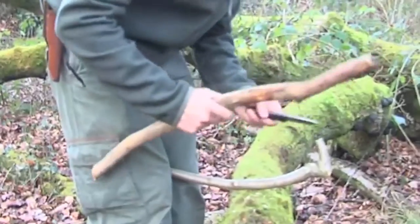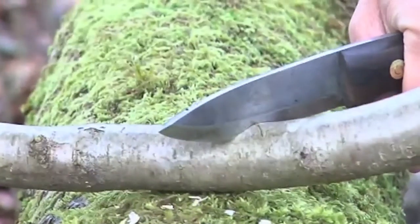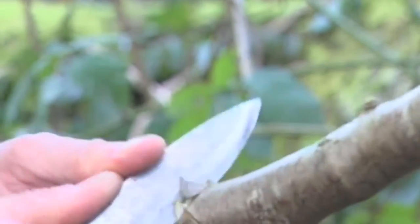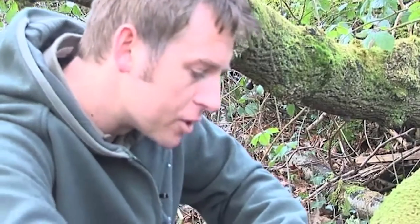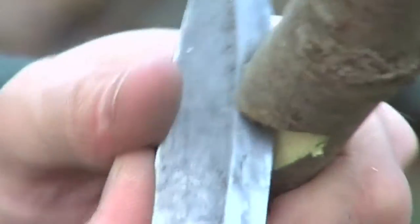Now I'm going to just cut a little cross into this piece of timber. Sharp tap on that side — just take away some of the surplus material. What we're looking for is something like a bird's beak, so that this section here protrudes out and scoops in just a little bit. I'm going to take that a little bit further.